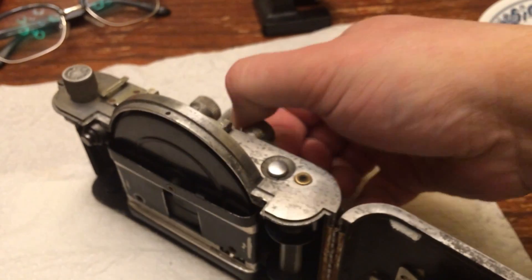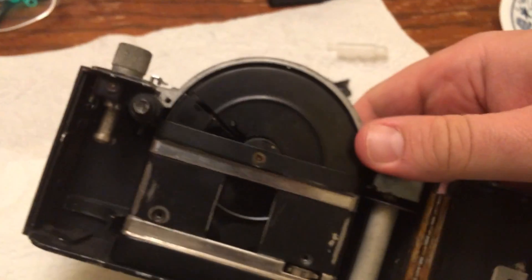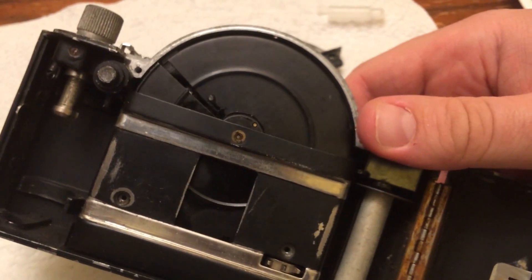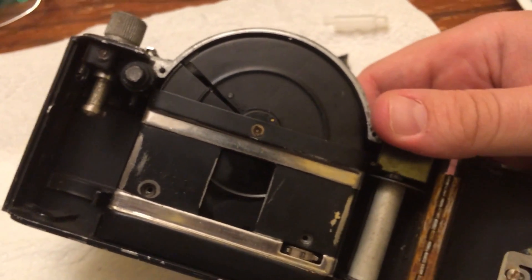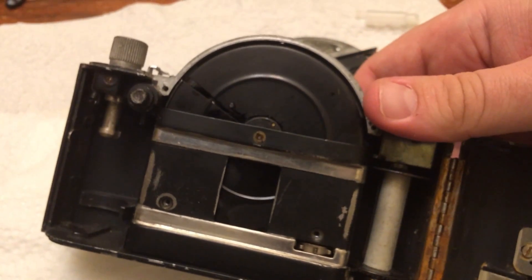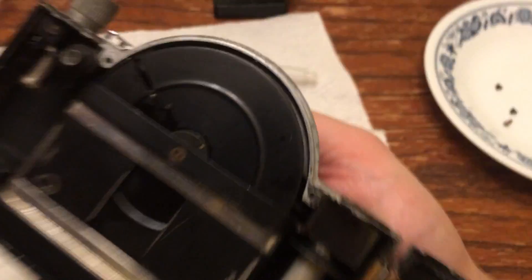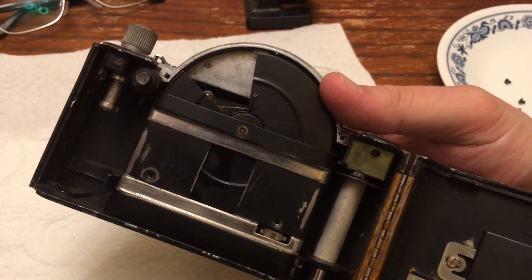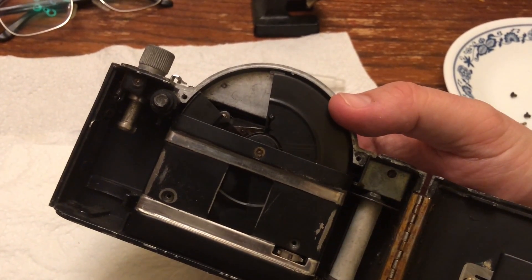You wind it here. You can see there's a little gap here — it's like two halves of a circle, and the size of that gap as it passes in front of the lens determines the shutter speed. We can widen that up with this thing here. I just went to a slower shutter speed, meaning that the mouth of the little Pac-Man is wider.